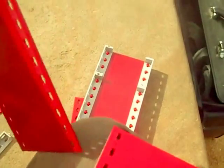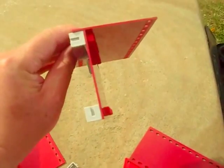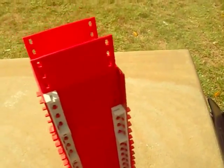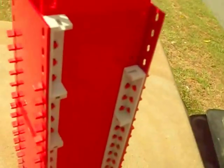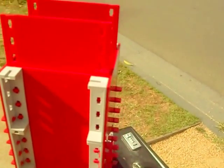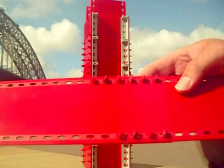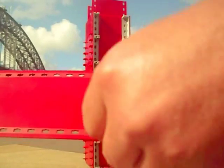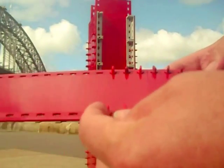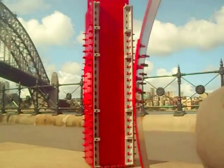The plates are flat and are quite easy to bend. Angle iron is riveted onto the edges of the plate — that's half of it, that's all of it, and that bit just goes there like that. Then rivets are banged in and together it goes. The rivets go red-hot, the end gets bashed over by somebody on the other side with a riveting tool, and when they cool down they pull the plates together so hard that the plates physically grip each other. The rivets clamp the plates together — the stress doesn't go through the rivets, it goes directly from one plate to the other. The rivets just clamp them together, but as you can see, that's not very strong on its own.